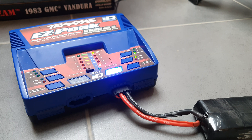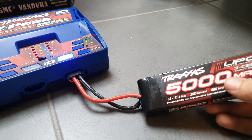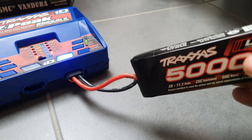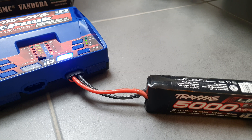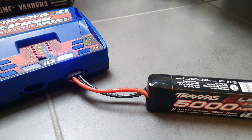It works! Normally it would have shut down by now. I think that when the voltage drops below five volts the charger refuses to charge the battery — mine was at three point five volts. Thanks for watching, don't forget to like and maybe subscribe to see more videos. Have a nice day!